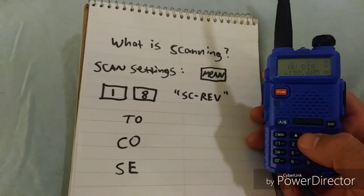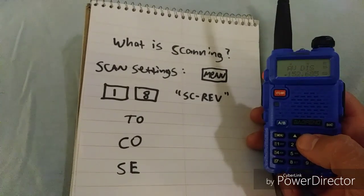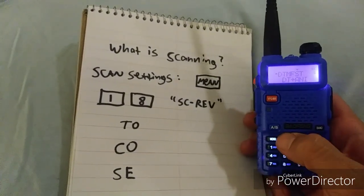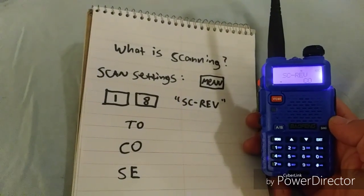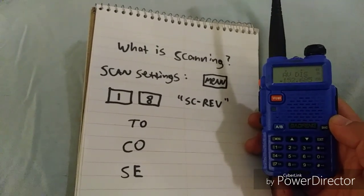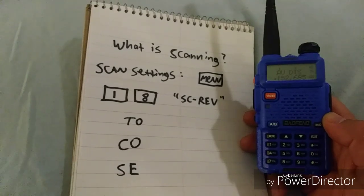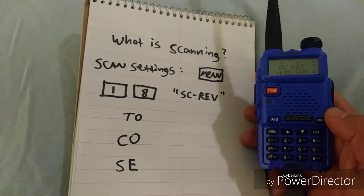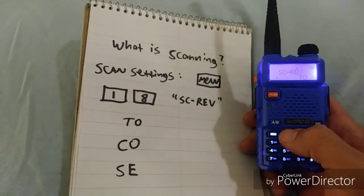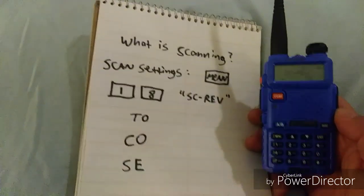This is my preferred setting. This radio seems to listen for about five seconds — there's probably a way to change that in the software. The other radios I have listened for about 10 seconds. The C-O setting will stay on the frequency as long as it hears radio traffic, so if somebody has a 60-second or a two-minute broadcast, it'll stay on that frequency that entire time before continuing once that traffic drops off. The search function allows you to scan and the first channel it hears radio traffic on, it'll stop on that channel and will no longer scan.